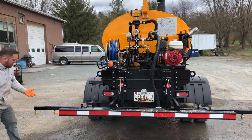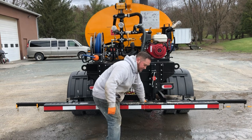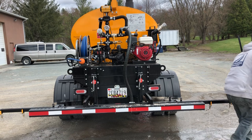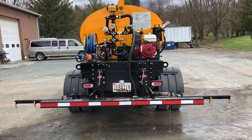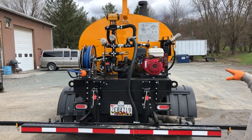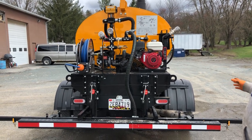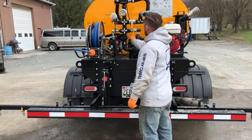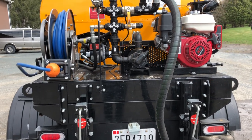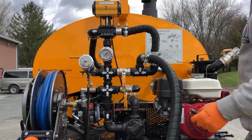Being that we're on a flat surface here, I'll open all the valves and let this material — in this case water — drain out of these spray bar valves. After that, I'm going to close the valve for return to tank and allow everything that's in the system to be pushed out through the valves for the spray bar and for the sealing wand as well. Number six is for the sealing wand. I've got every bit of pump pressure going to the spray bar. I'll turn off the valve for return to tank so there's nothing in that line.